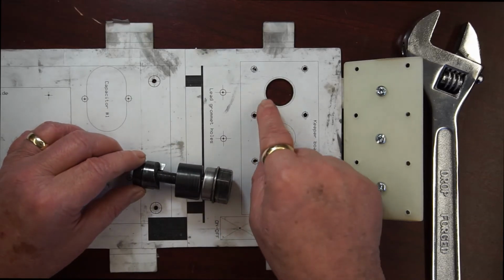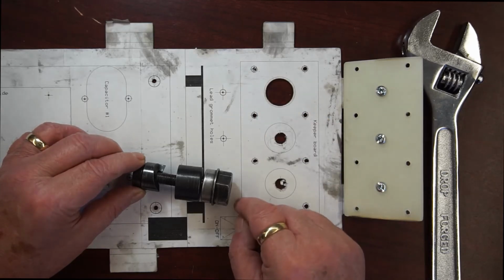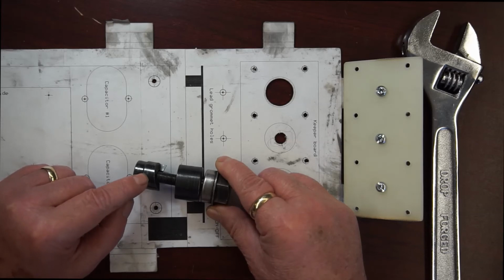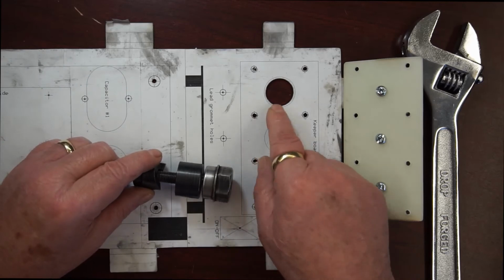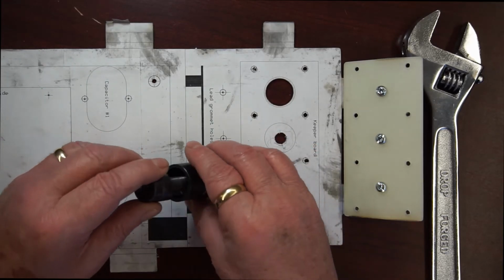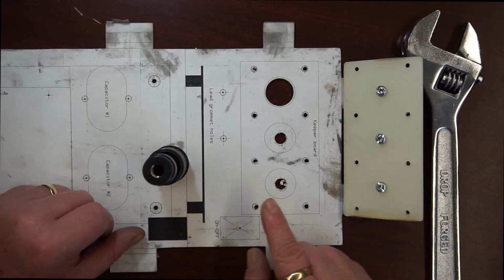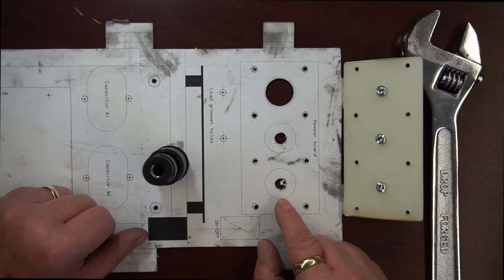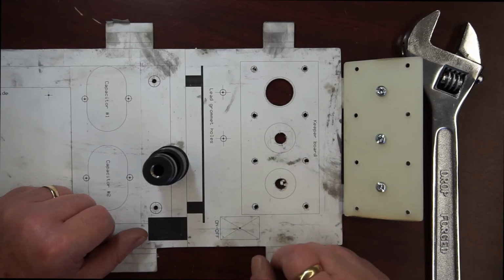The hole which results may have a very small lip on the inside, so it's useful to set things up so that the cutting cylinder starts on what will be the outside and punches through, leaving the lip on the inside. If you don't have a punch, then the best thing to do is to drill a medium-sized hole, say a 1/2 inch diameter hole, and then to use a round file to enlarge it to a satisfactory size.